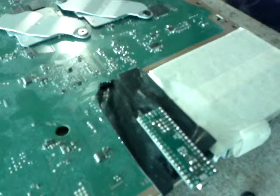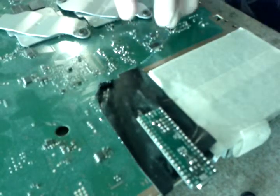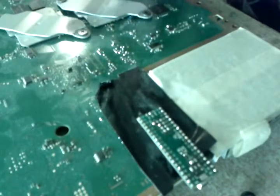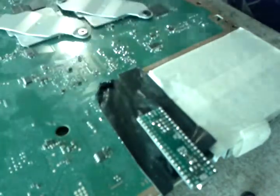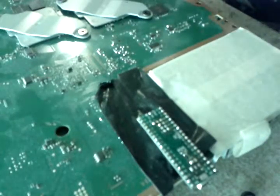And when you start soldering this up, the best tip is to start from the outside and work your way in towards the point, so that you don't ever have to go underneath something to try and solder. Everything is done in order. And find your wiring diagram on the PS3 dev wiki for actually soldering it up.